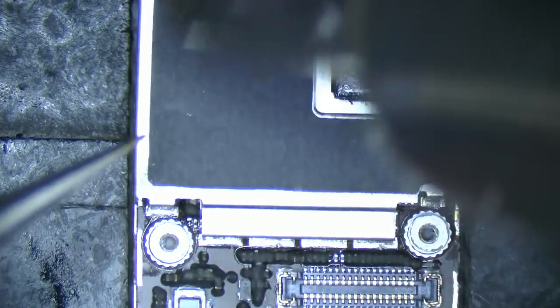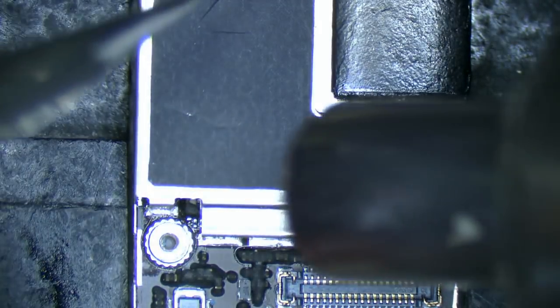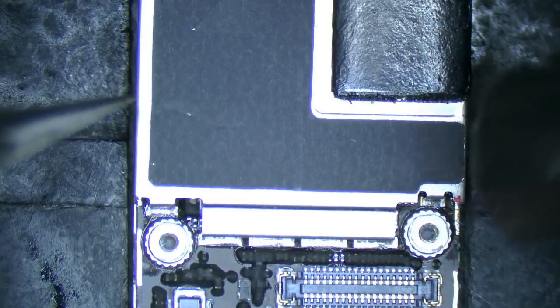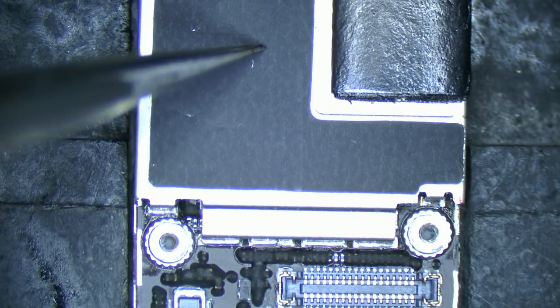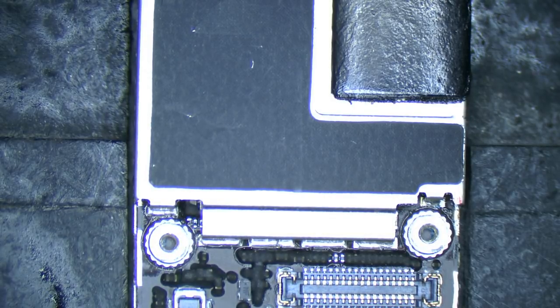And we're looking for a transition here. I admit, this is a bit harder under the microscope. There we go — maybe just tap down a little bit. Wait for the transition back, which takes quite a while on this particular solder. And there it goes — finally just transitioned back there. It might not have shown up on the video, but hopefully it did. And now the shield's attached on all sides.